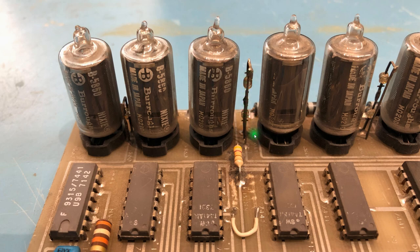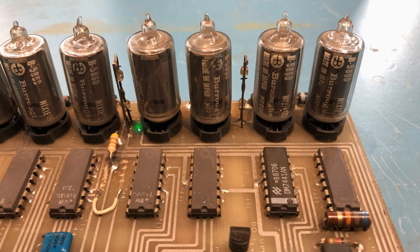I didn't get a great view of this center colon, but you can see the three pins mentioned — the center pin comes up between the two displays. The tubes are B5860s, I think they're all 5860s. Looking at the other side of the board, you get another view of that center lead coming up here, which I believe means you could light the two dots in that colon individually. There's also some repair work visible where the blown-off trace has been jumpered — not a bad little repair.